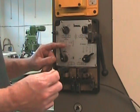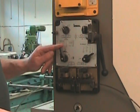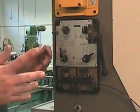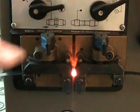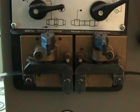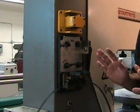And as soon as the blade crushes, it's crucial that I relieve the pressure that I'm applying on this lever. So let's take a look at that. Push the lever right to the end and let go as soon as you see the blade lurch forward. The blade is now welded, but it is extremely delicate.